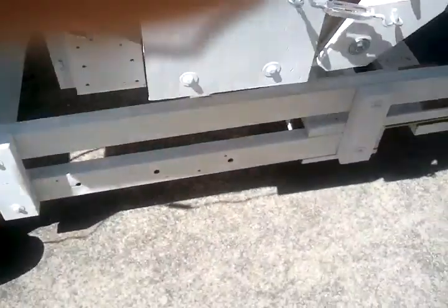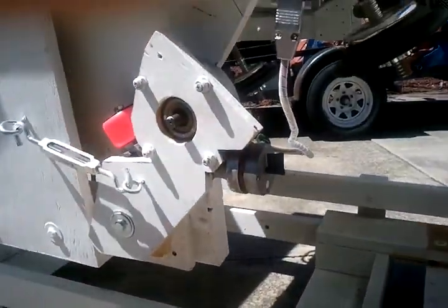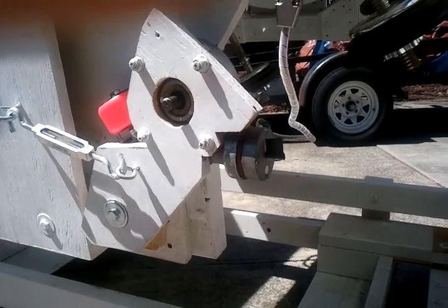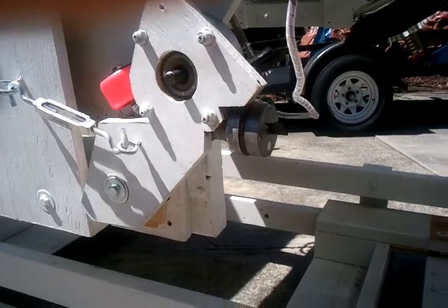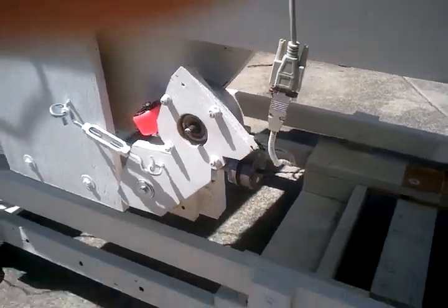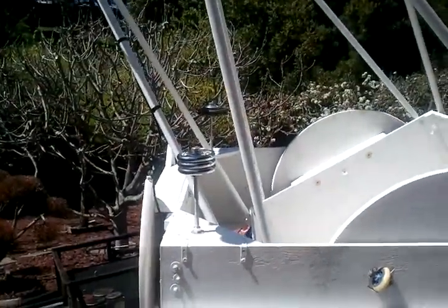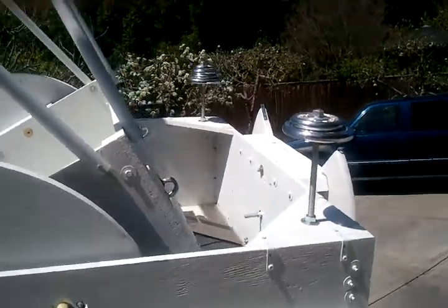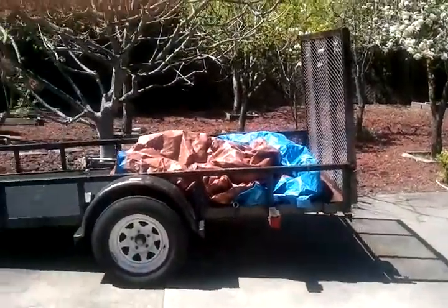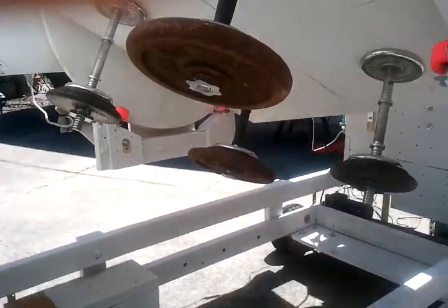The second axis is over here, both being driven by the controller. You can see the little tail on the end — the black piece of tape moving around — and that's the compensation rate for this particular position. The scope is balanced with those weights balancing the carriage independently of the tube, and these weights down here are balancing out the tube.